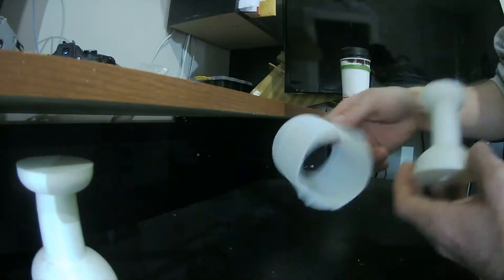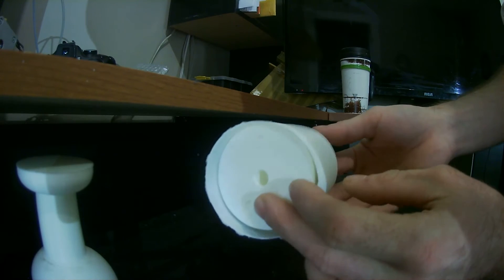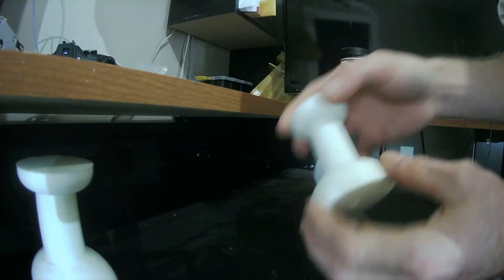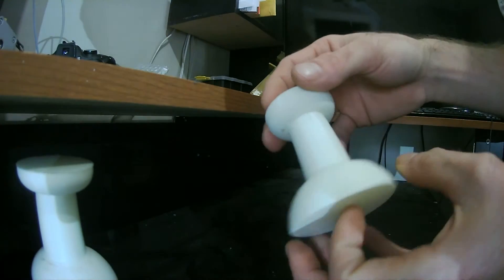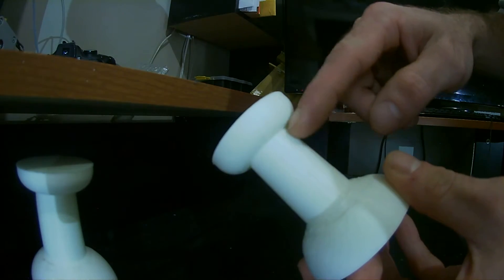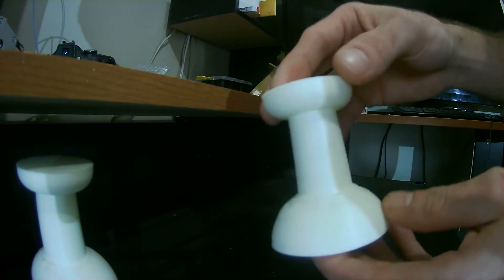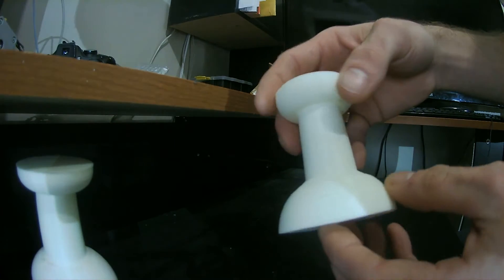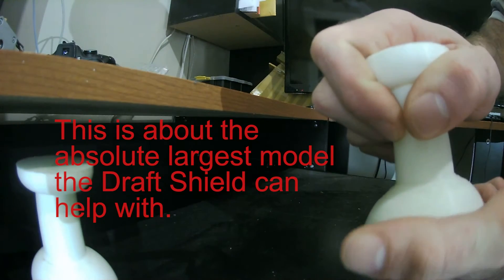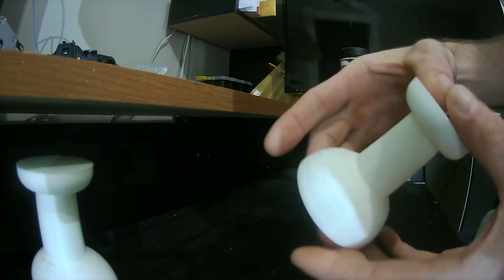And it just feels pretty weak — I'm going to split that if I pull on it too hard. And then this is the draft shield version. It prints literally a shield around it as it prints. This is the one that was printed inside that. You see there was a bit of underextrusion somewhere in here — those aren't actually splits. The only real split is one here, and I guess it feels a little weak, but it's much stronger than the other one.